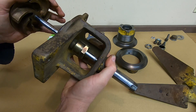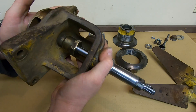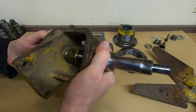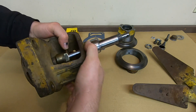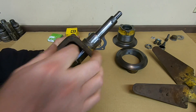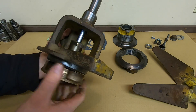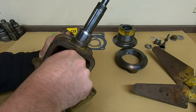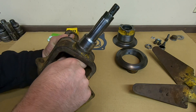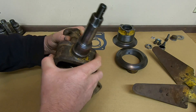We're started through the seal. There's a nice amount of drag on that impeller shaft — I know that dust seal is going to be back to doing its job. I'm not going to cinch the packing nut down too tight at this point either, just enough to feel a little additional drag on that impeller.